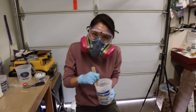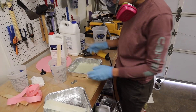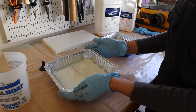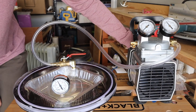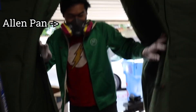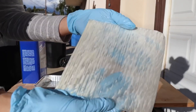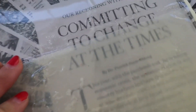The final step is to replace the chromophores that have been stripped out of the wood with resin, which stabilizes the wood and has a refractive index similar to cellulose. As you'd imagine, this introduces even more frustrations related to curing, vacuum chambers, and the excitement of implosions. It's a fun, frustrating, and enlightening video with a great cast of guest characters. As for the utility of transparent wood, I can see it being a beautiful material for making lighting fixtures, but it's a heck of a journey to get there.